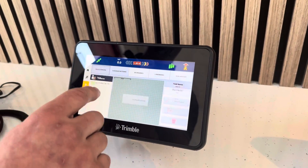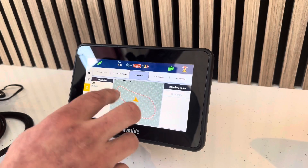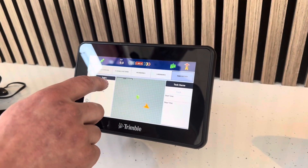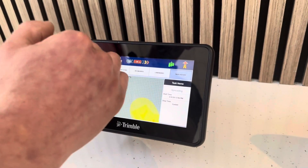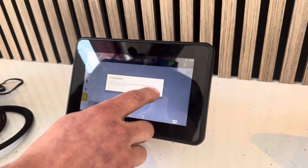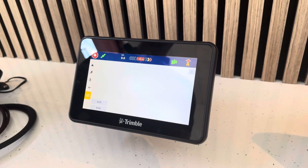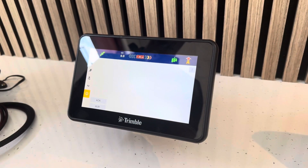Field manager allows us to see the total field area, the lines we have created in the field, and the boundary of the field. If we want to mark any landmarks, points in the field, or take off any exclusion zones we can do that in here. The task history shows today's date, time, and a map, so we'll have a record with each field. We've also got a diagnostics menu and the UT function - this display can be unlocked for ISOBUS, giving you the ISO UT function as well, which most entry-level GPS systems won't have.